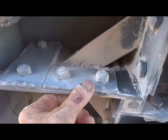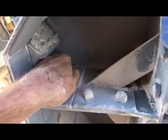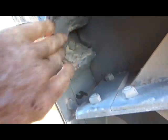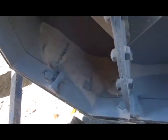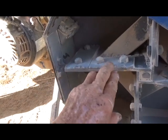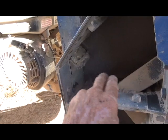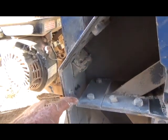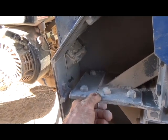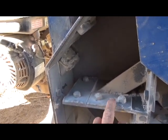At a thousand pounds of material, the hard facing doesn't even need to be redone, although it's starting to get worn in some areas. The rest of the material is fine. So my thought is that quarter-inch plate with hard facing works quite well at a reasonable weight. If you hard-face basically the entire perimeter with a little extra on the corners, you can run one side and then swap and just reverse them, leaving the other sides on the hard face.